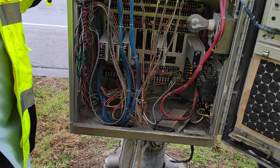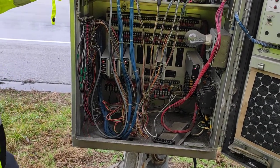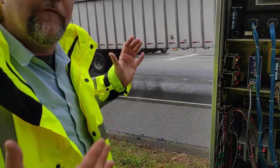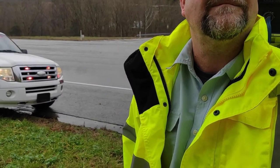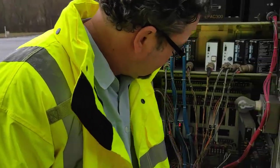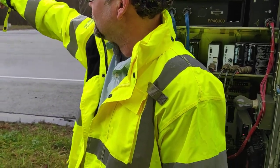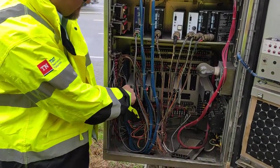We were just getting familiar with orientation — phase orientation. If you walk up here and look out, how many movements of traffic can you see just by looking at your signal heads, not looking at anything in the cabinet? Four. So that's four phases — a straight through, a left turn, straight through that way, and a left turn. If you look down in your cabinet, you can see those load switches — four of them, a load switch for every phase.